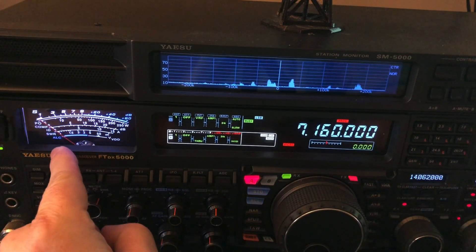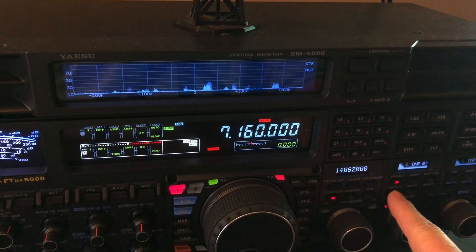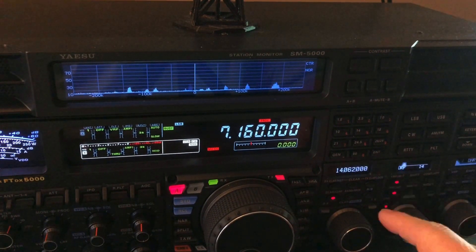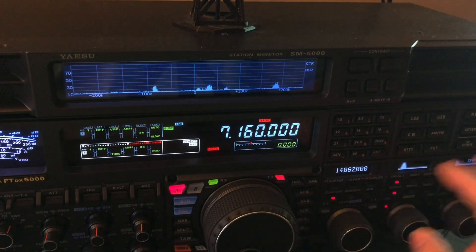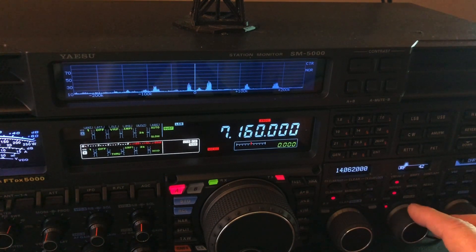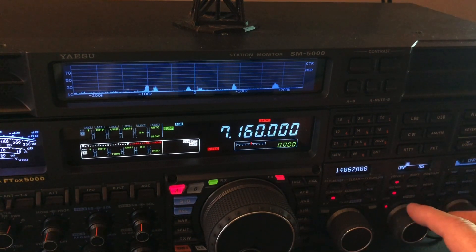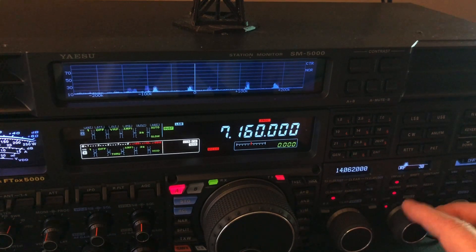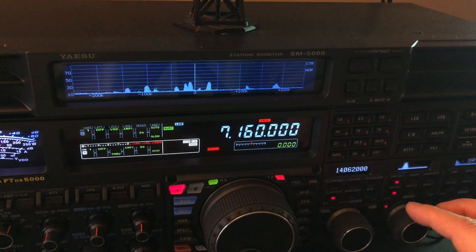Look — not even moving the S meter. I've got digital noise reduction on level 7, my manual notch set at 800 Hz, and VRF on number 14. Those numbers are assigned to internal LC networks — that's not important for your use of it. Just rotate it until it sounds good — that's the simple instruction. I'm knocking the noise down to a point where I can still hear him and the noise is much below him.